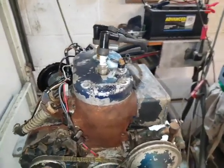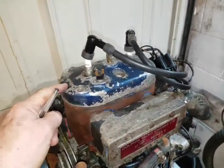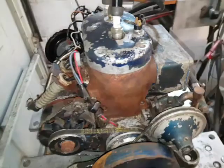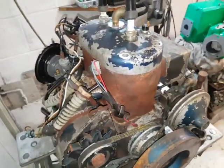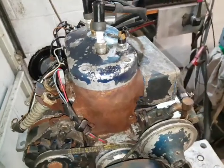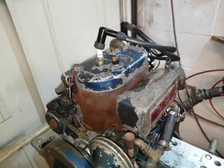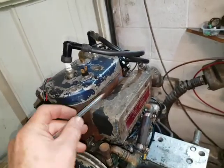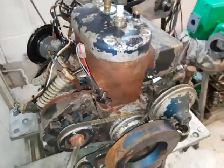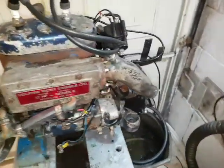Then you've got two similar metals. This is like an old Austin engine, isn't it? A sort of 1920s. You'd have a cast iron head and a cast iron pot. And I had an Austin Somerset once, 1954. That had similar things. Had a cast iron head, cast iron block. It had a solid copper gasket, I remember, and it's quite nice and squashy copper. So it could be the solution, but you've got all these other aluminium bits on the engine, so I think the whole engine is destined to rot and corrode after about 10 years anyway. But maybe the owner would be happy with that.